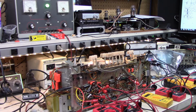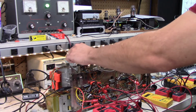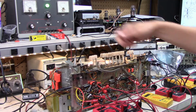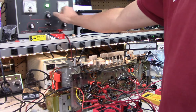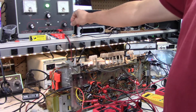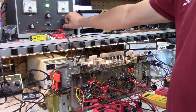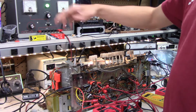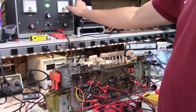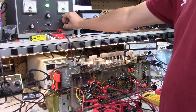At this point, I'm just checking the power supply. Those are down. Alright, well, moment of truth. So I got this all the way down to 0. Switch it on. It always gives a little blip. Alright, so we'll apply a real low voltage, and if there's a short circuit somewhere, this thing should just spike. Or it should just be unusually high for whatever voltage.